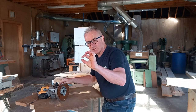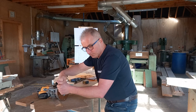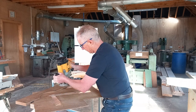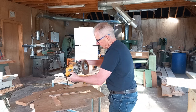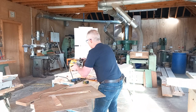We'll be using a depth, you normally do it in 2 passes. So you'll run the first one and clean it, and then you plunge the second cut. There's a depth stop on the router here obviously, so the depth for my particular cut in this case is already set. If I push it down fully, you'll see that there's the full depth from the base to the top of the cut. That's that done.